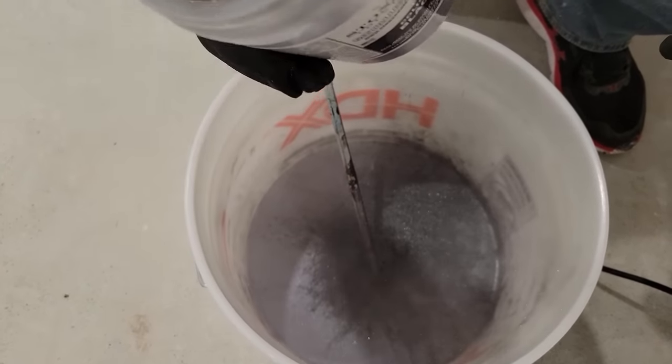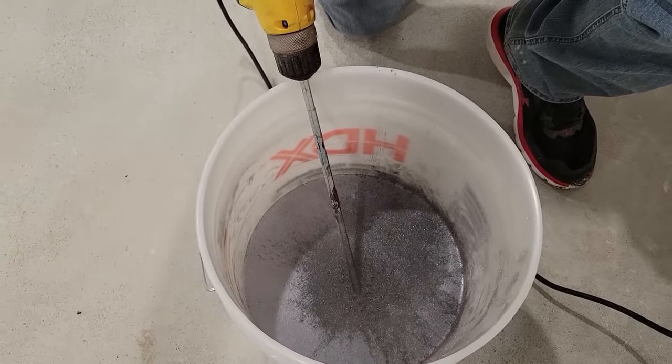We're going to add metallic. Why do you add metallic? You want black underneath just about any color. It magnifies and accentuates it and makes it look deep and basically really good. Metallics is how I tint my epoxy because it looks like a floor should. It's not spray paint, it's not dye. We're not making it look all like stone. We're doing a coating of metallic-infused epoxy.